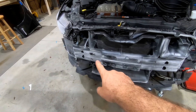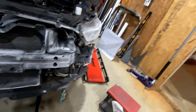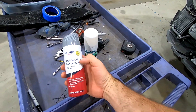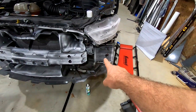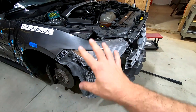All the white on the car is just a powder — they do make specific 3D scan spray, but I just used some dry shampoo, this Batiste. I also tried an athlete's foot powder spray; it's not as good — I'll put a screenshot of the two side by side doing that oil cooler right there. First things first: it's very hard to scan shiny black or dark stuff, and it's also impossible to scan things like headlight lenses without some sort of powder or coating.